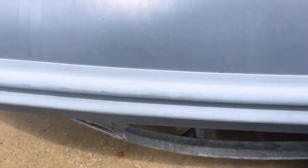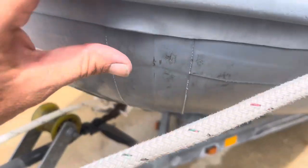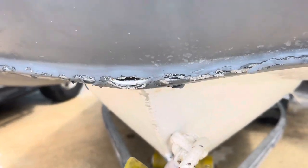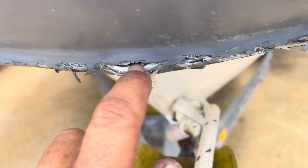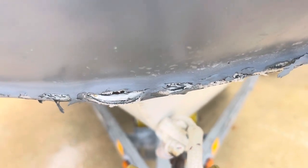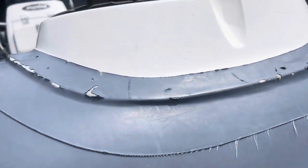The tube haul strips are fine, the valves are fine, there are no other leaks. We do have a bit of detachment at the rub rail, and we've got some severely delaminated fabric up here at the bow — I would not be surprised if they were getting water in through there. We have the same delamination up at this bow apron.